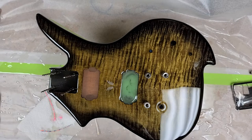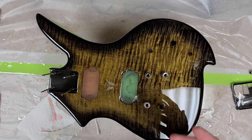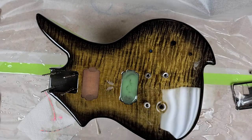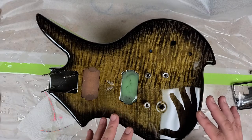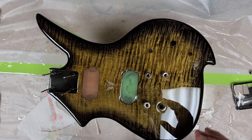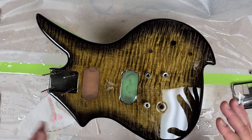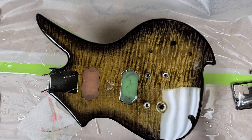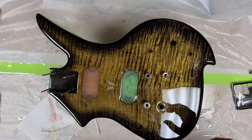So what happens is the pores let air escape from the wood, and you start getting bubbles. Another problem is that if you stained or dyed the wood and the wood is still wet, that's going to cause problems with bubbles as well. So you want to make sure the dye or stain finish on your project is completely dry before you apply epoxy to it, because it's going to end up making bubbles, and that part is a real nightmare. Take it from me, I know.